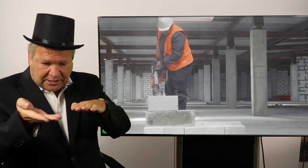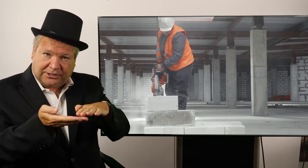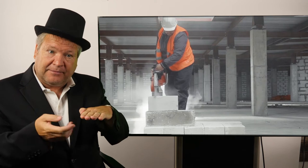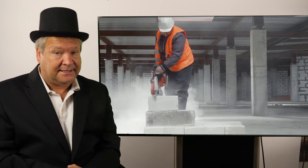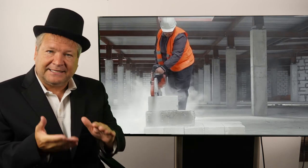The way to fix a brick joint is to take out the joint — grind it out using a grinder going top and bottom — and repoint it using regular mortar. It's called repointing or tuck pointing. It can be expensive, but the idea is to bring that new bond back so that it doesn't have water intrusion getting in.